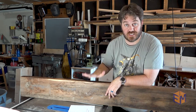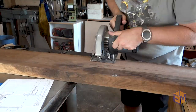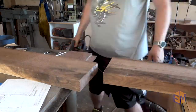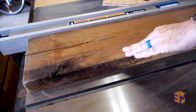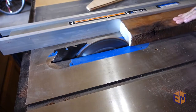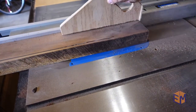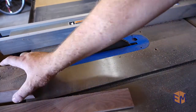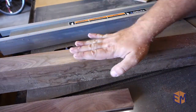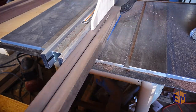I have a little bit more work to do because this is not dimensioned. First things first, we're going to build the arms of the ladder. I cut the boards down to rough length and ripped the two bases I needed for each ladder. I decided to make two ladders, which allows for more people to play at a time, but you can also play with just a single ladder. I cut the uprights to rough width as I still needed to square up all of the boards.